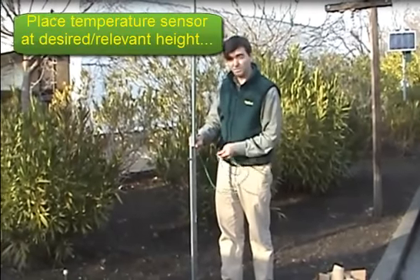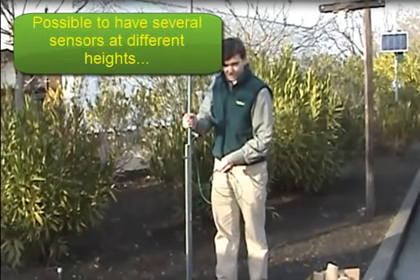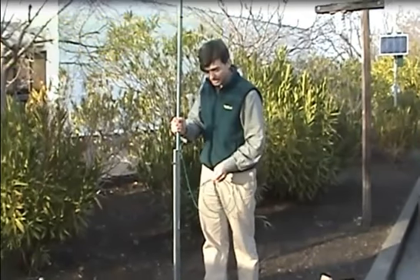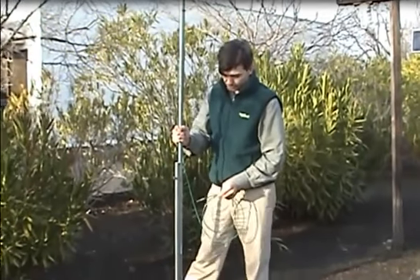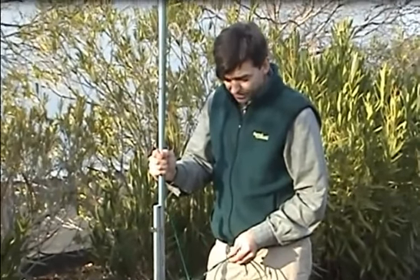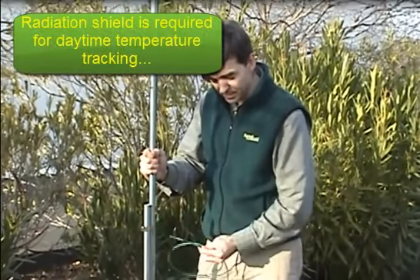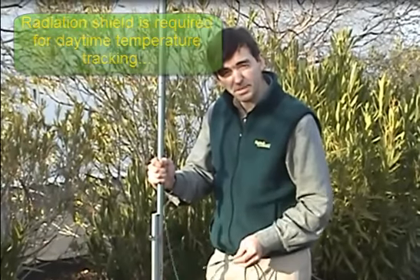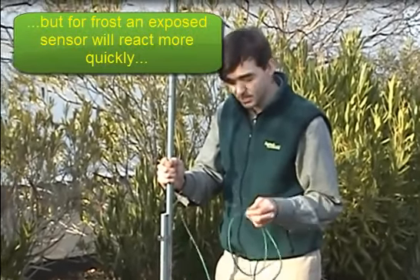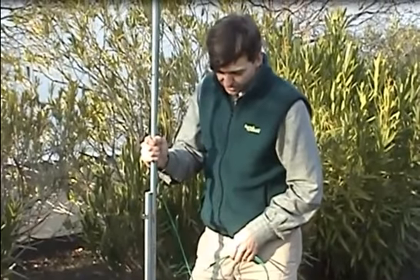It's possible to have more than one sensor on one node — there are plenty of ports — so you can have frost temperature readings at different levels. Higher locations are often predictors of what's to come, so some people use two or three temperature sensors. You may also see a white radiation shield that the temperature sensor is placed inside; that's essential for daytime temperature measurements. But for frost detection, it's actually potentially better to have the sensor completely exposed, so you get the fastest reaction to temperature and wind chill.